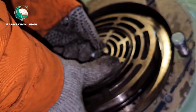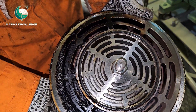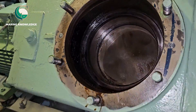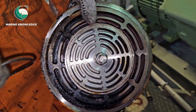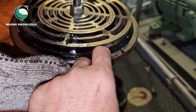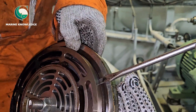You can see an o-ring on top of the valve. One side is completely covered in carbon deposits while the other side is clean — this may indicate improper cooling and high lube oil temperature. You can see two o-rings on top of the valve. Always make sure you are renewing the valve o-rings: one on the side and one on top — two o-rings total must be in place before installing the valve.